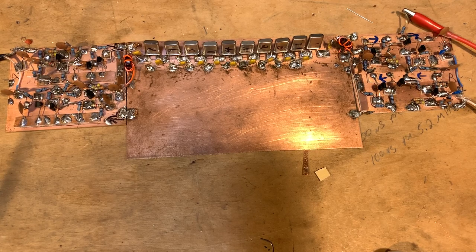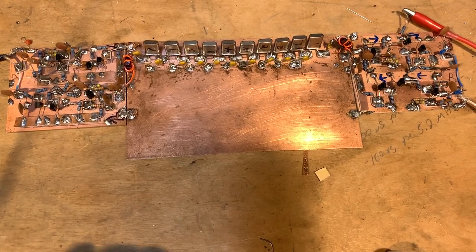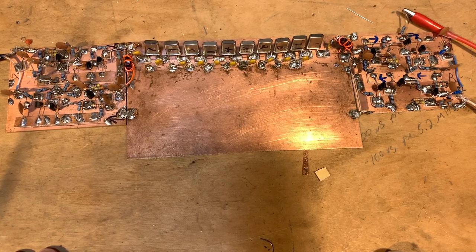I had a lot of trouble with this, because even though I knew it was 50 ohms — confirmed by the Antuino showing a 1:1 SWR — I wasn't getting 50 ohms on the nanoVNA. So I did some head scratching and consultations with Farhan and with Alan Wolke W2AEW, and I think we've come up with an explanation of what went wrong. Alan is going to make a video about how to use the nanoVNA to measure input and output impedances on amplifiers.